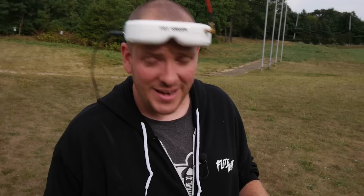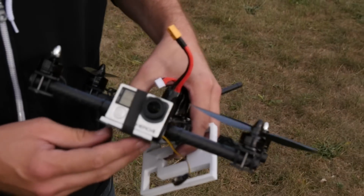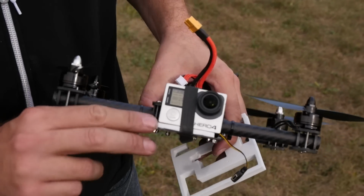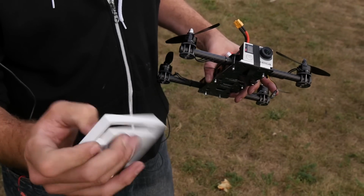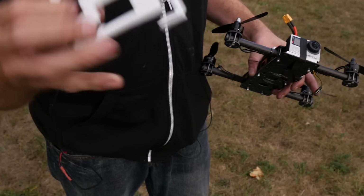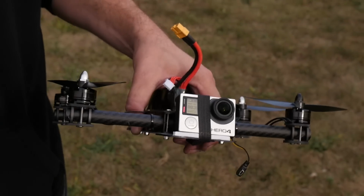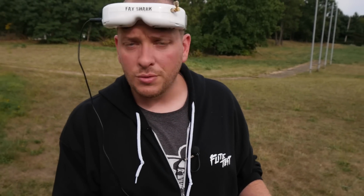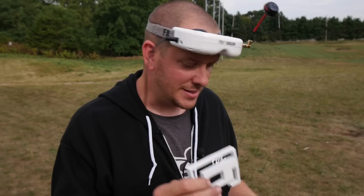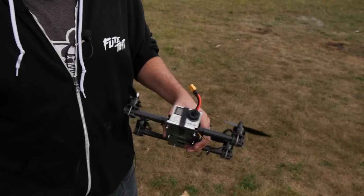All right, so I went ahead and I took off the lens cap number 1, but also I really like to fly forward a little bit faster. So what I did is, you can see this little white piece of foam rubber. In our little electronics case, there's this really nice spongy white rubber. All I did was cut a little section off of it and hot glue it underneath here. So if you buy a video transmitter or you have any of this stuff laying around, even if you got the 2204s in the case, it has the same material as this. It's really, really good to give yourself a nice vibration dampening, and you can also adjust your angle here. So that's just a little quick tip for you.